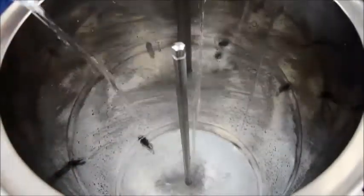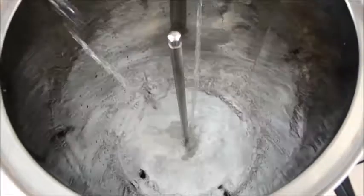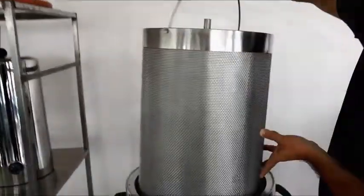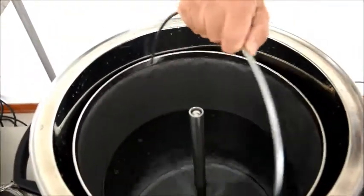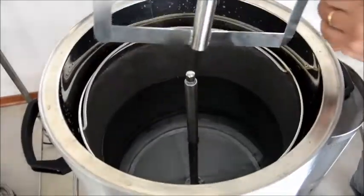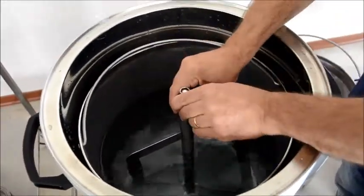Put the water required for production inside the Mastro Gourmet and Camurri Brewer. On the container you can find 5 notches, which indicate 30, 40, 50, 60 and 70 liters. Once the container is filled, insert the filter and the mixer. Switch on the unit with the switch on the PLC, which will turn on the previously programmed PLC, as shown in the section How to program the PLC.